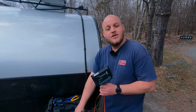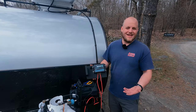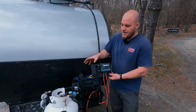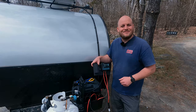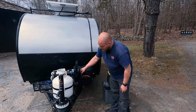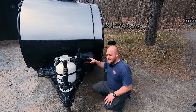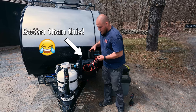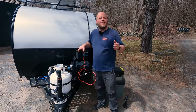Now that everything is ready to go, I'm going to show you the final way I install this in the box. I take this little block of wood — I screw two pieces together and painted mine, though that's completely optional. This slides in the box and holds the charge controller steady so it won't rattle around. I put a hole here as a thumb holder so I can slide this out of the box. The wires just tuck neatly inside. For 99% of the time it's going to be operating in the box like this. If I open the top, even with the wires coiled up, I can easily see the wattage, power going into the battery, current, voltage, and state of charge. If I want to pull it out, make sure you train your wires — swirl or loop them instead of doing fan folds.